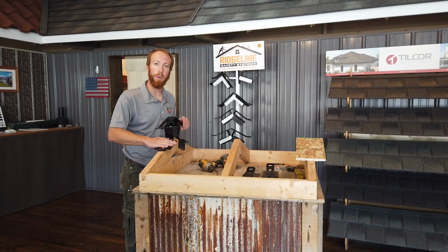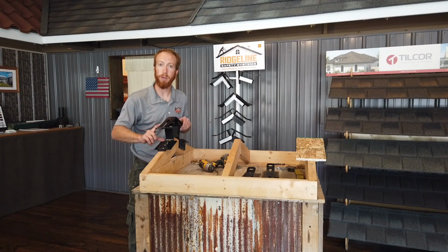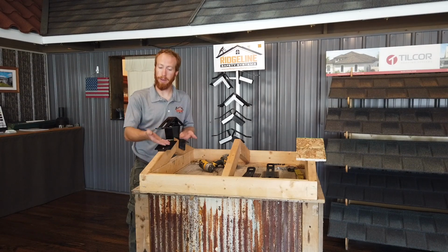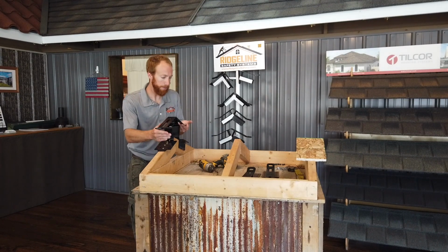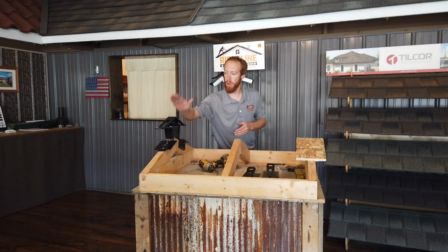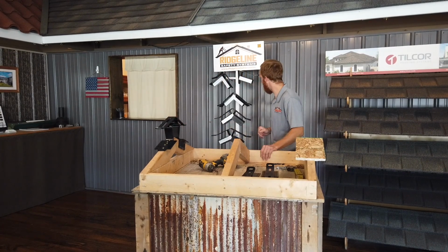The throat on post-frame versions is going to be either tall like this to accommodate a 3.5-inch purlin or 1.5-inch purlin. That's about the only difference there. These will bend up to an 8/12 roof pitch. There's the post-frame version. Next, we have our new construction version.